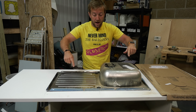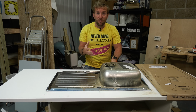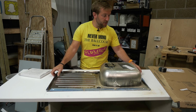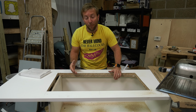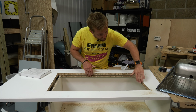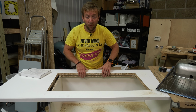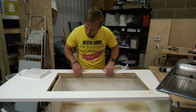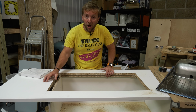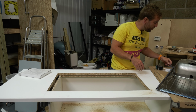Make your centre, measure out, or find out how far you want it off from the edge. It's up to you where you want it. So you're at the stage now where you can fix this down. Now, a good idea is you can get a lacquer, even if you haven't got the proper lacquer. Sometimes just get an enamel and enamel up these bits around the inside here, and also any bits at the top, any bits of wood that are just open and that could get water on them if your seal fails. Enamel all those up, because if the seal fails and this hasn't been enamelled, you'll find that this will blow. It might take years to happen, but it will definitely prevent it if you put that enamel on there.